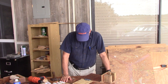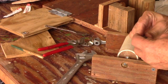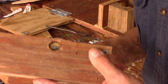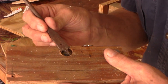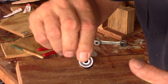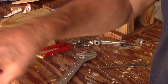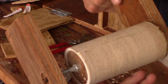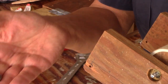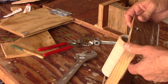The epoxy is drying and the next step will be to put the drum back on. Here's the bearing — it's three-quarter OD by one-quarter ID. I used a three-quarter spade bit to countersink the wood by a quarter inch once the hole is accurately located. That makes the sanding drum spin nice and smoothly. Since there's quite a bit of force when you put the wood through, I thought ball bearings would be the best way to go, minimizing that force and allowing the little drill to power the drum sander without bogging down.